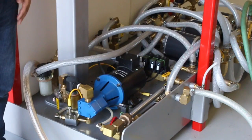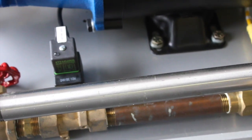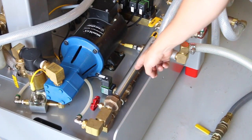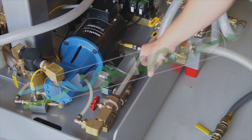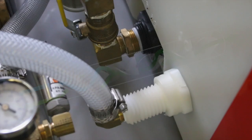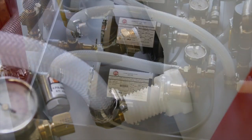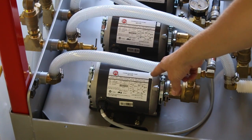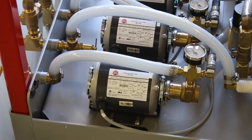So in terms of the actual mixing, does the Uniblend simply pump concentrate into a tank and just allow the water flow to create the mixture? Not exactly. To ensure a complete blend of lubricant and water, they are pumped through what's called a static mixer. This device mixes the fluids completely and then they are supplied into the reservoir tanks. Also, the mixed supply pumps pump the fluid through a recirculating loop, maintaining that homogenous mixture.